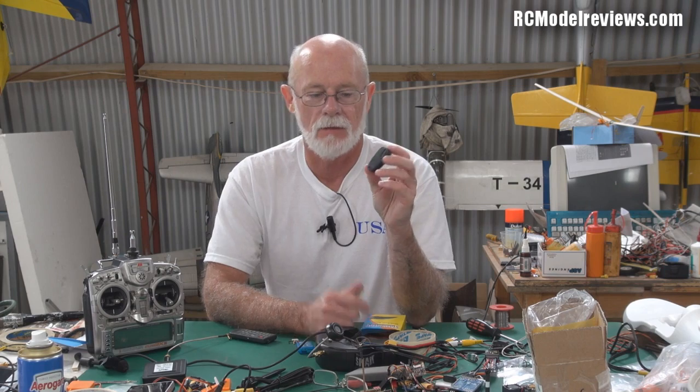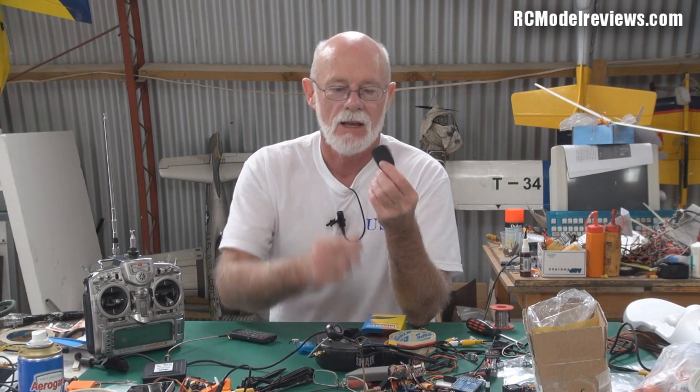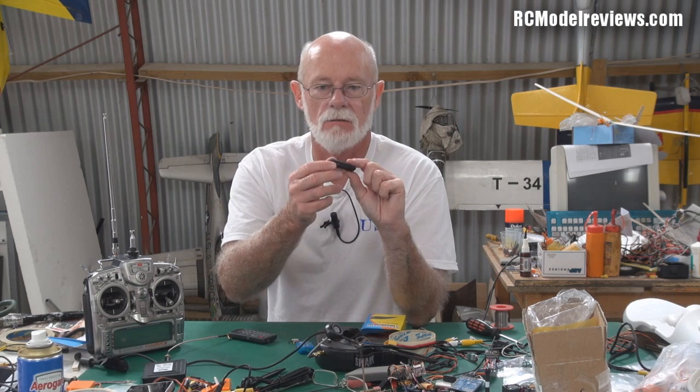In the recorded footage it had a timestamp because the camera was fresh out of the box - I hadn't reconfigured it. You can reconfigure a whole lot of stuff. To get the video out, you actually have to configure the camera - they come set for no video out. You make a small change to a text file, reboot with that new file, and it turns on the video out and turns off the timestamp. It's hard to find anything wrong with these - they're about 40 bucks. Compare that to a GoPro and the image quality is certainly better than 10% of the price. Value for money, it's all there.